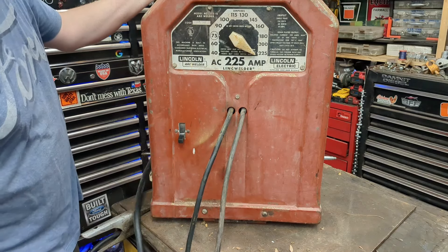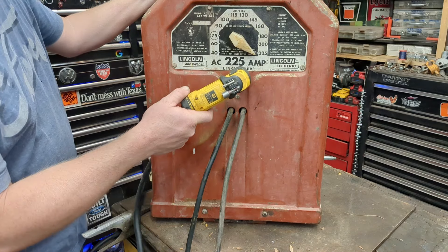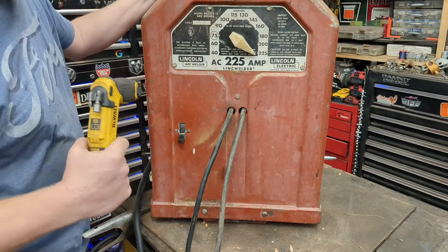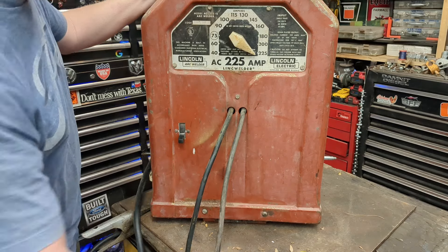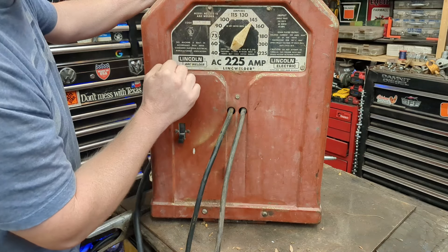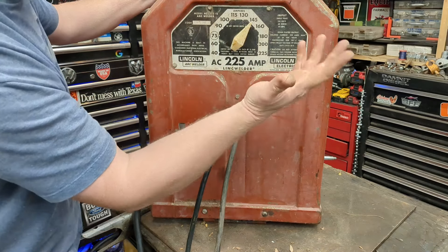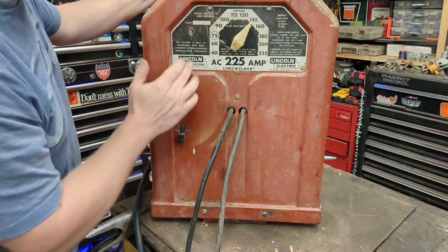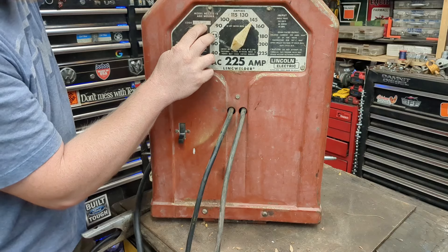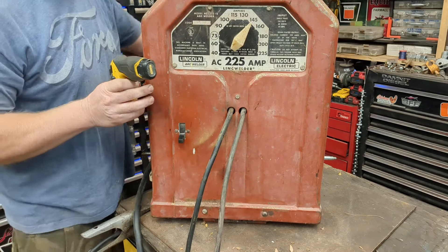This one is probably from the same era they've been making since the 60s or so. They only went up to 180 amps until sometime in the late 60s or 70s when they started doing 225 amps, and they're identical from the 70s until the ones you can buy at Home Depot today. The way I usually tell the age off the bat: in the 80s and 90s these little connector things are plastic plugs - white - and I think they went to black plastic plugs in the 2000s. So this is probably from the 70s. The date code reads 507 - that would be the seventh month of either '75 or '85. I'm going to assume 1975.